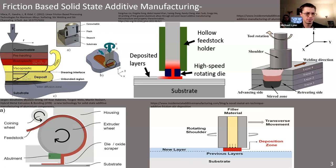Some people have used wheel extrusion — it's been called many different things historically — which essentially uses a wheel to generate a large amount of force due to friction on your feedstock, whether a wire or plastic filament, and forces it against an abutment, basically a stop, causing the material to suddenly change direction and flow out of a nozzle. And there's a technology already commercialized at large scale called additive friction stir deposition, which uses a hollow shoulder or hollow pin. Material — whether powder or wire — gets fed down this pin, and as it flows to where the pin is touching the surface, this material gets extruded, stirred, heated, and formed into solid metal or plastic on a surface.